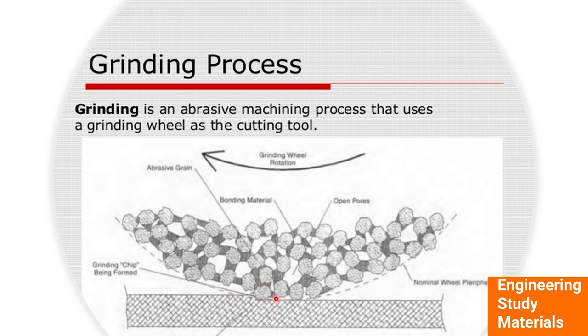There is one more interesting thing: when the top layer of the abrasives gets worn and the bond becomes weak, the tiny abrasive particles fall off and the second layer of abrasives comes into action — this is the self-sharpening mechanism of the grinding wheel.